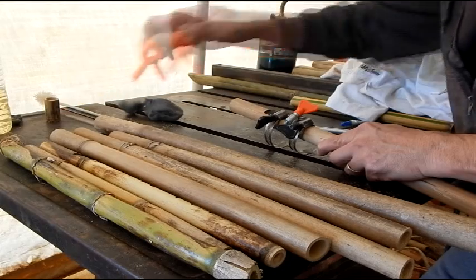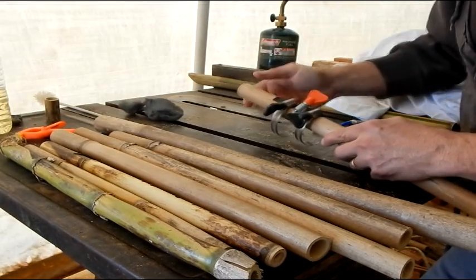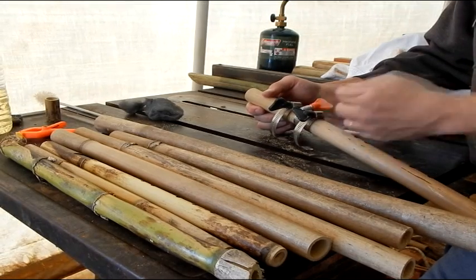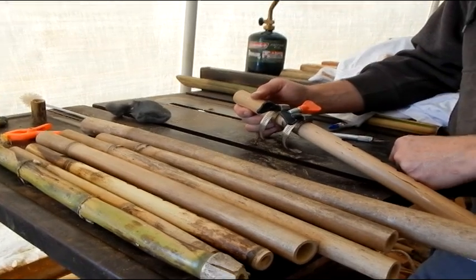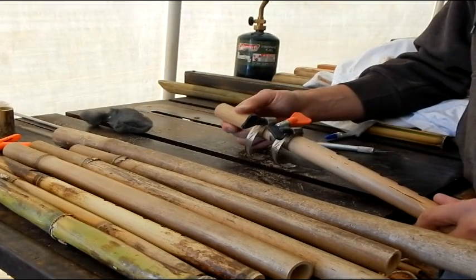In some cases you might find even these little squeezy clamps come in handy to help keep the cracks together. This particular piece was so tense that the squeeze clamp wouldn't help me, and I really needed to use these hose clamps. I like the hose clamps with the little butterfly wings on them. They're super handy. I get them from automotive stores. I don't think your regular hardware stores carry them. Some of them may. You may get them in the plumbing section too in some hardware stores.